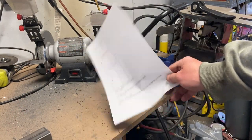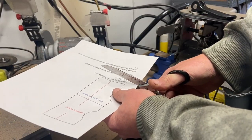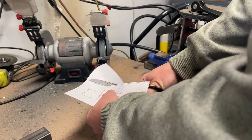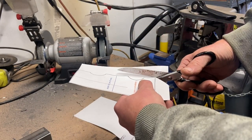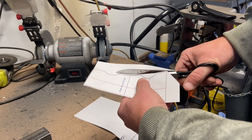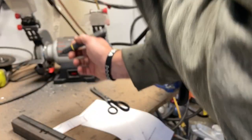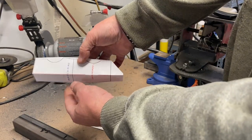J8 is your first cut wrapper and it's a pretty easy one because it's on square tubing — you basically just cut this out. I like to leave a little tail to make it easier to tape. If you're using a notcher, you don't need to cut this out exactly. On the plan it says seven inches to the end — put a mark at seven inches. I fold it just to make it easy.